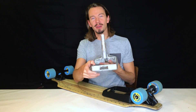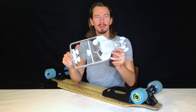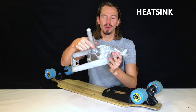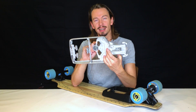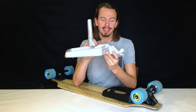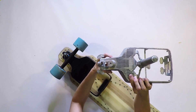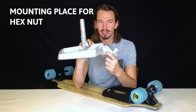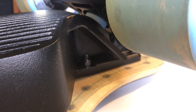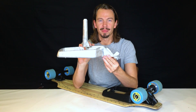On the back side you have the opening for the snap lock system. On the top of the Mellow Drive you have the heatsink, where on the other side the braking resistor is pressed in. And there's a little detail in this pocket right here — there's a mounting place for a hex nut. So you don't have to get your tool in there or anything; you just hold the screw down with your finger and you can easily install the Mellow Drive on your board.